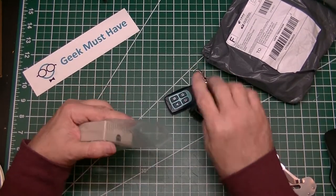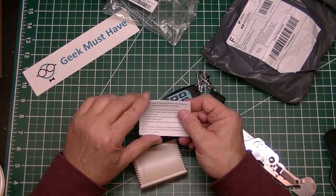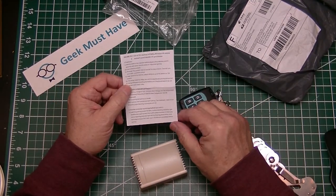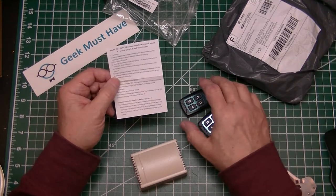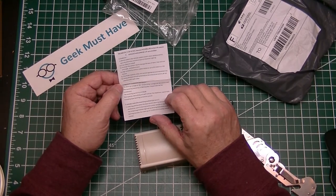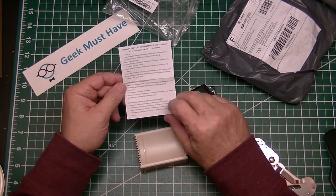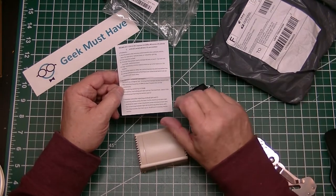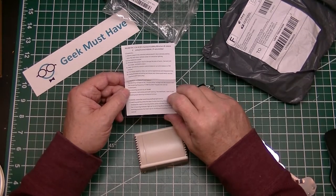Two key fobs. It is a four-circuit remote control running at 433 MHz with these wireless controls. It's mainly used in the remote control of electronic door and window switches. It has four passive outputs. Through the jumper you can change how it works — you can have it latch or not latch. Up to 50 meters range according to the instructions. The working voltage is 12 volts. The receiving frequency says 315 here, or other frequencies, but I do think this one is 433.